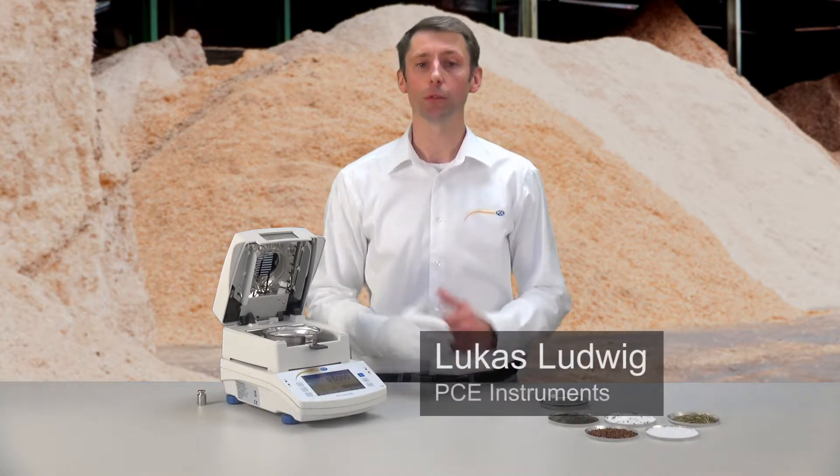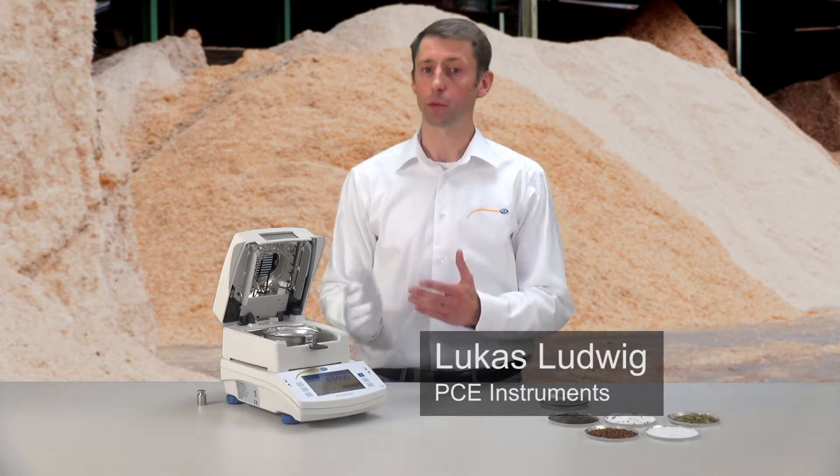After construction, in the style of the recognized and well-known analyzer scales, the moisture analyzer derives its weighing technique from the scale analyzing area. Here the sample is weighed, dried, and weighed again. Should after many weighings no weight difference be recognizable, then the moisture analyzer ends automatically.